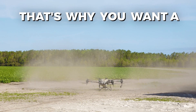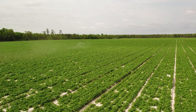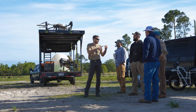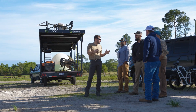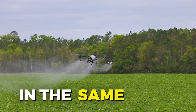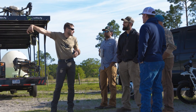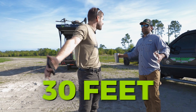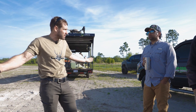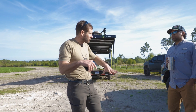Oh my gosh, that's why you want a trailer. So we're going to fly four drones, so we split the whole field into four different fields. You can also do route segment — one big field and then drone A flies zero to 15, the next one does 15 to 25. I don't like doing that because then you have drones in the same field. If I have drones running right next to each other, they won't collide because they're technically in different fields. Target height is 12 feet above the crop and you'll get a 30-foot swath. But today we're bringing it down because of the wind, so it won't drift as far — the swath will be narrower and it'll take longer because we're flying lower.